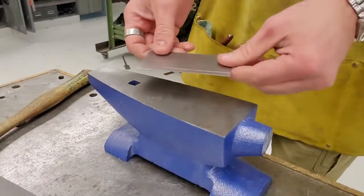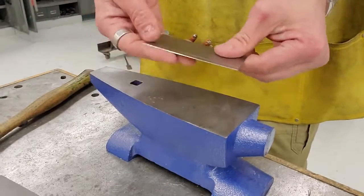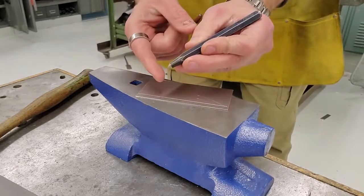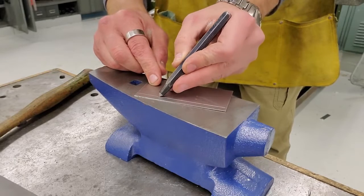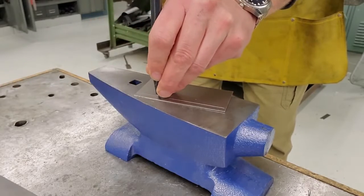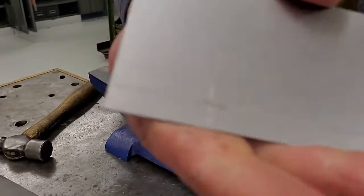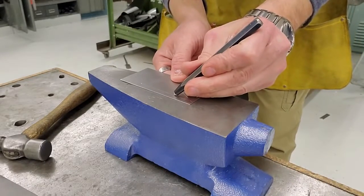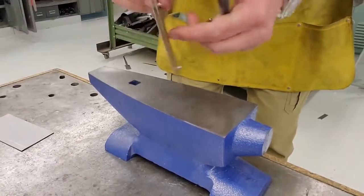We set a piece of metal on an anvil — we do not need a piece of wood between our sheet and the anvil because we're not punching a hole, we're putting a little dent. I've got the center punch tipped over so I can see the point; I'm going to set the point right where the two lines cross, stand it up, and take a hammer. You really don't need to hit this very hard — we're just putting a little dent. We've got to do that four times total.